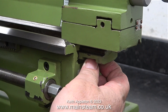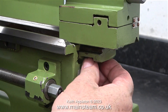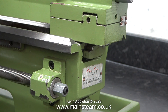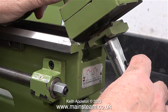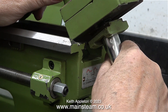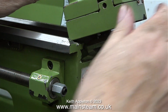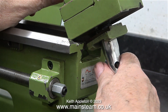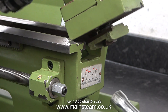The fitting of the tailstock is very important. Originally it was quite loose. The general idea is you adjust the bolt to move the clamp as close as possible to the bed — not like this; this is a rattle fit. It needs to be quite close but not tight. It's trial and error. I'm using a box key to get it in the right position. This was too tight, so I backed it off a bit and tried again. Eventually I got the bolt in the right position, although it did take a few attempts to get it just right.